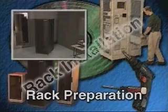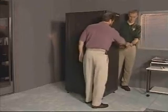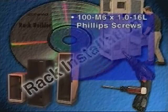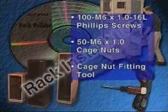With the site location determined and your racks and components delivered to the room, you can begin installation. Roll the rack to its permanent location. The hardware components included with your rack are a vented front and rear door, keys, a vented roof, mounting brackets, casters, and leveling feet. The mounting bracket hardware includes 100 M6 by 1.0-16L Phillips screws, 50 M6 by 1.0 cage nuts, and cage nut fitting tool.